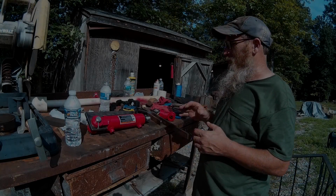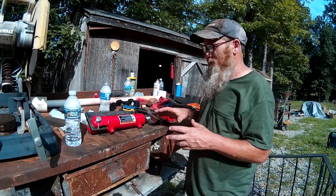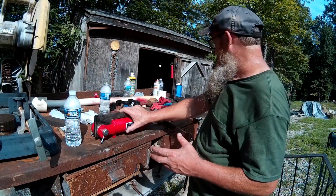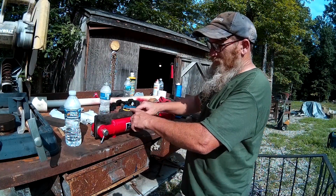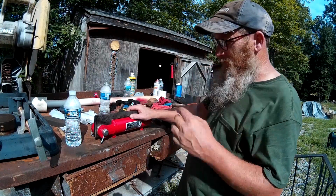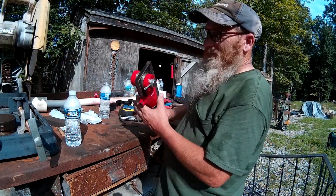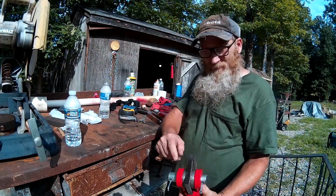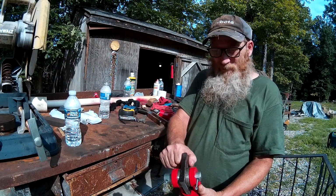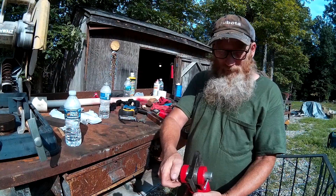Okay, so let's update where we're at on this hydraulic tilt link. Last part of the video, we cut this piece out of this piece of plate steel, and we've gone on and we've bored a hole in it. We machined 2 shims to go in between here to take up any slack it might have, and we put the pin in.